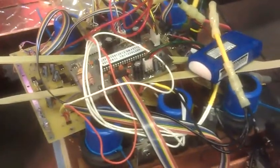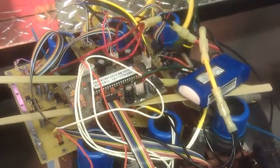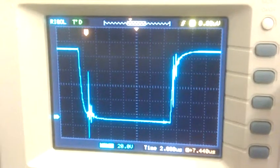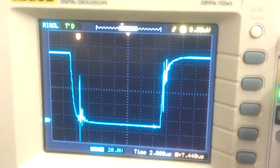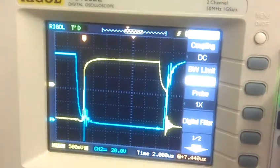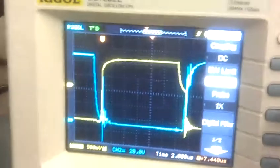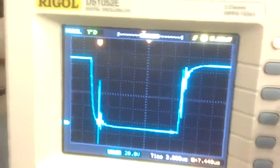Basically, the high-side MOSFET gate gets connected to the phase wire, and that's how it gets pulled low. So you can see here there's a ring. When it gets pulled low, that's actually the high-side MOSFET gate we're looking at there. So now I'll watch what happens when I turn the low side on. You can see it lines right up with where the false turn-on event is. When the low side is trying to turn on, it's actually causing a false turn-on event in the high side.